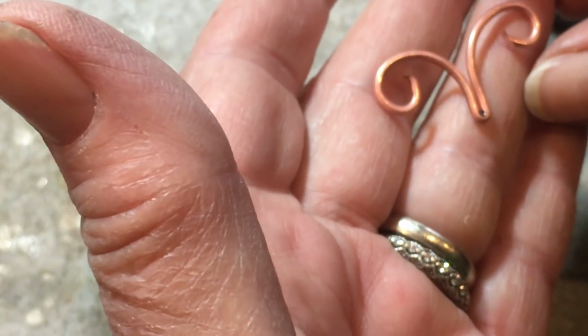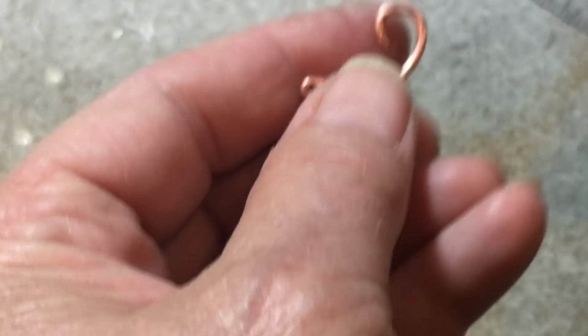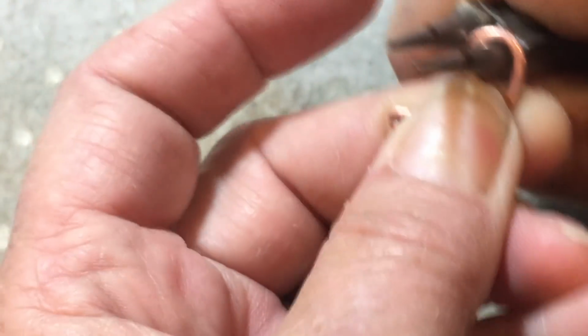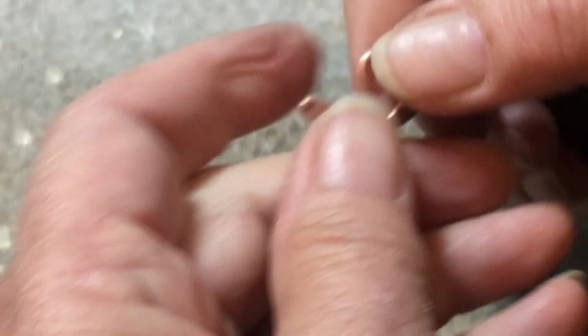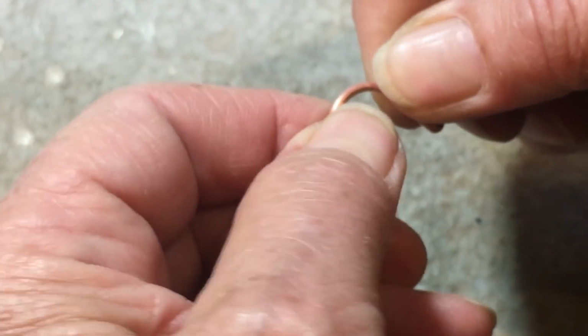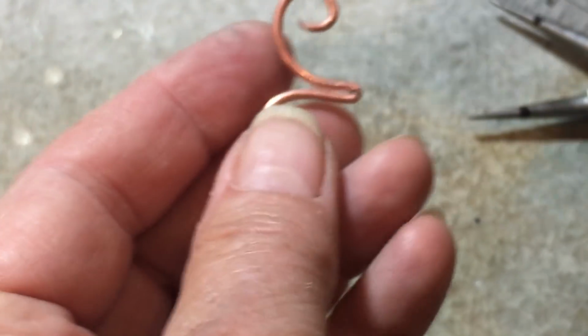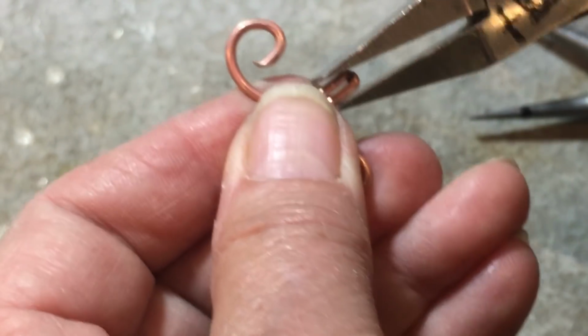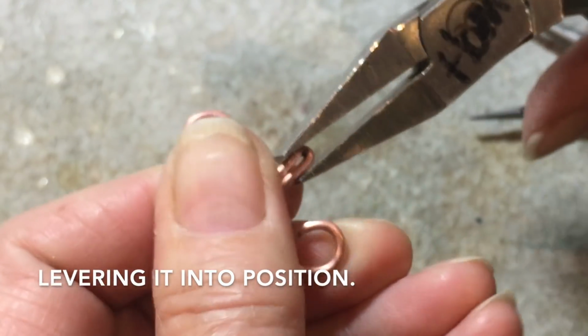And I think that this arm here is a little straighter than this one. So I'm going to try, desperately, to push these pliers all the way up at the end and kind of push this metal up with my hand while pulling down with my right. Doesn't always work. Sometimes you have to kneel it. And I want to make sure that this center part here is straight, which it isn't. So I can put the plier here and squeeze down from the top side, trying to bring that point around a little better. It's all about resistance.